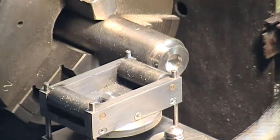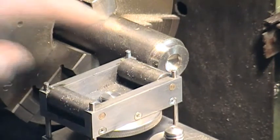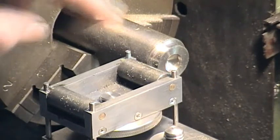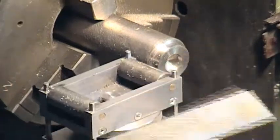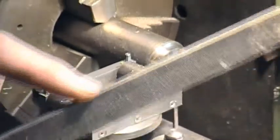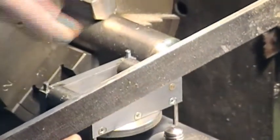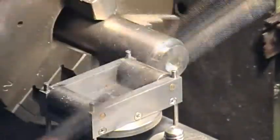Okay, we're mounted on the compound. We've got a bit of scrap in there and I've just been putting a little bit of a flat on the top here. This is a crappy old file, so it just happens to be handy. One thing is this file has a safe edge — and for this job generally speaking you want to file with a safe edge; if you haven't got it you've got to grind it off. So we're only taking a cut underneath, and this is a coarse cut.